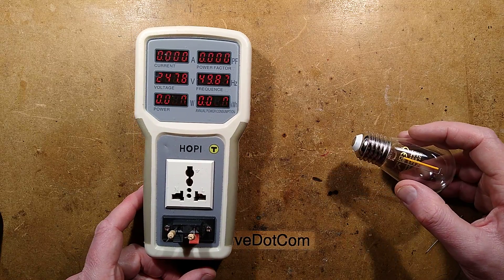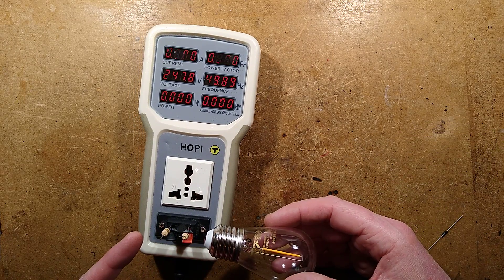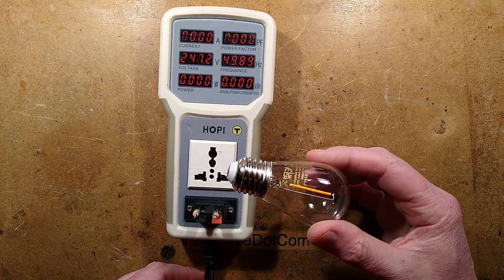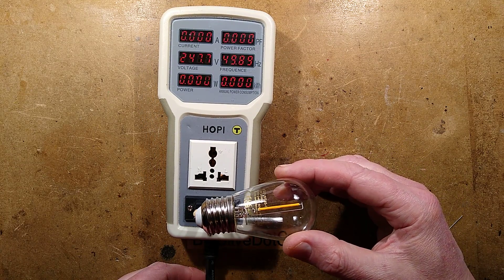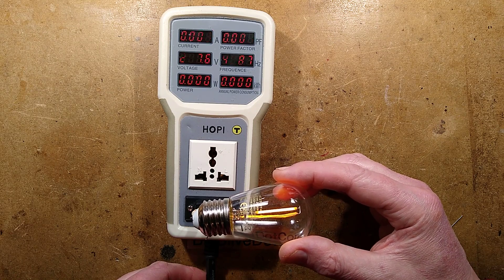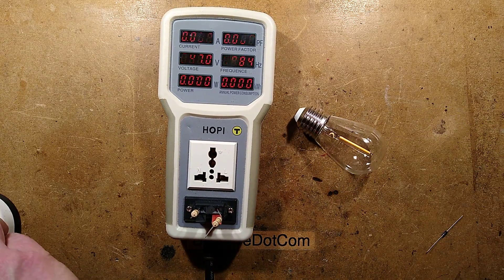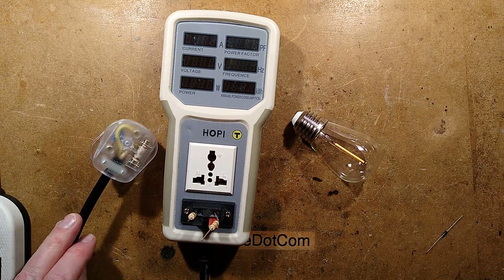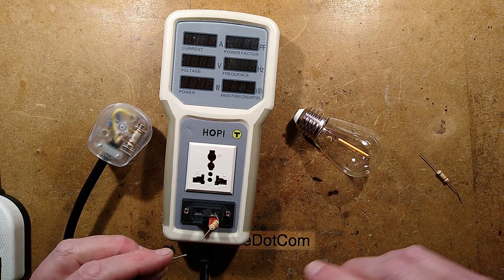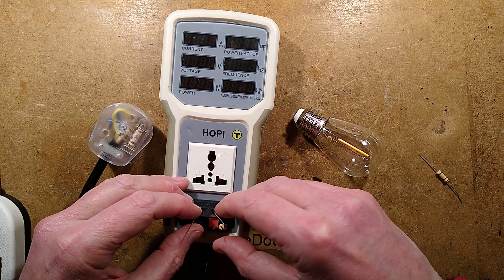All the tests I'm doing are a 'don't try this at home' type of thing. I've got two high power resistors, each rated 100k. If I put the lamp across them and it doesn't strobe, that suggests it's not got a switching power supply in it, because those tend to strobe and flash. And it's just glowing there very dimly, which confirms that. The next test - I'll unplug it first, and once again, don't try this yourself at home with exposed connections. It's done this way here because it's just more suitable for the video.